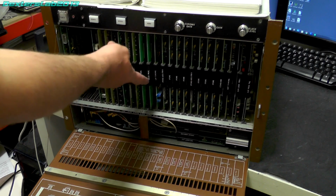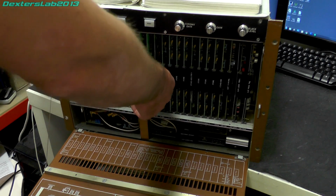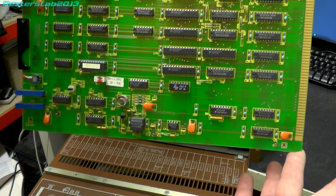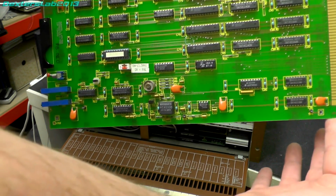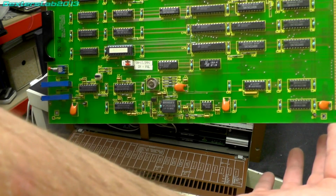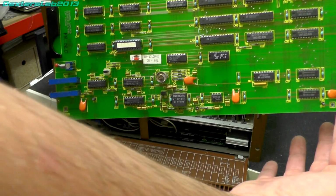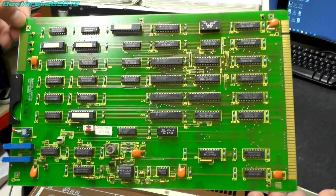So the next card along is exactly the same, and as it said, they are completely interchangeable, so they're identical. So the next one we need to look at is the input timing card. The introduction says this card is used only for live video input and is enabled when video input is selected by the artist. The computer sets function 0 in the status word of the brush address card and causes cell video to be asserted. This allows signals from the card to drive the address control bus and enables video data into the brush bus. When video input is selected, this kind of takes control and starts feeding data into the actual system.